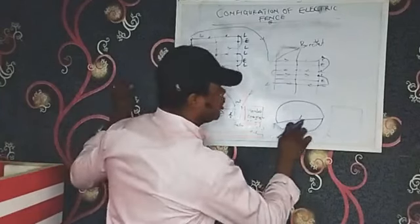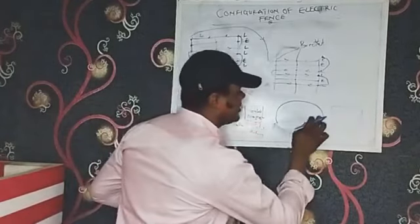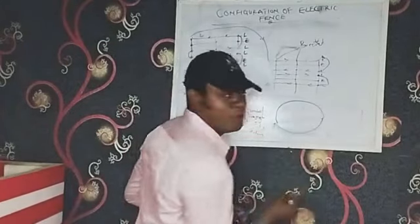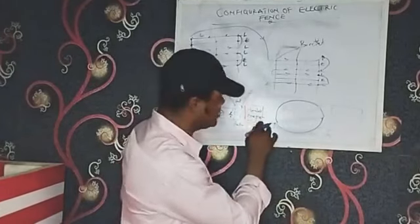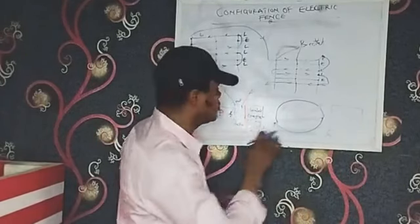So that's why I said you must have it in series, so that by the time any of the lines of a connection is broken, the alarm will trigger. By the time you open this place, if it's open here, there's no connection to this energizer. It senses it. The energizer is at point A, it senses it, the alarm goes off. Fine.